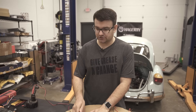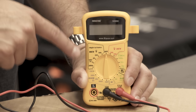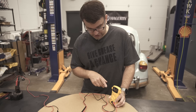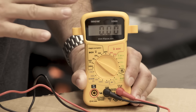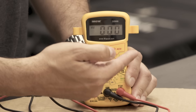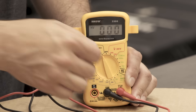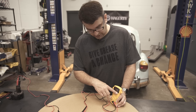For the sake of testing voltage, I've got a little battery here hooked up to these leads. Since there's actually electricity at the end of these leads, I put down some cardboard so our metal table doesn't start conducting. This multimeter has multiple options for voltage — it basically moves the decimal point around. We know that cars are 12 to 15 volts, so our 20-volt max setting is going to be plenty. You can move it up to 200 or even 500, but while you gain headroom for voltage you lose accuracy — you can't see portions of a volt at the 500-volt setting. At 20 we're great; we get accuracy to the hundredths of a volt.